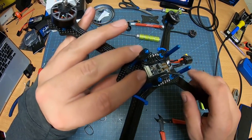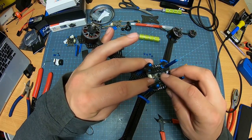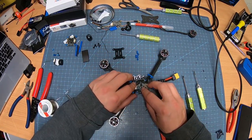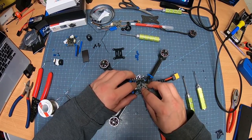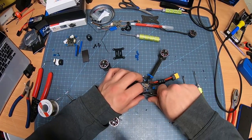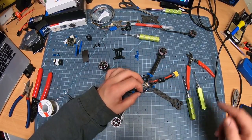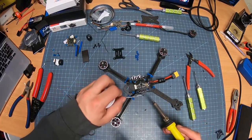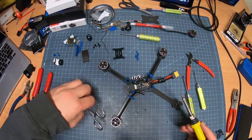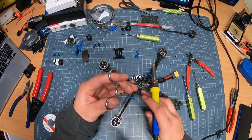If you solder these wires and let them sit over that, and let's say you hit a tree or something like that, your wires might get cut. I think proactively on this, and I will make sure to situate those wires to where they're not hanging out right on top of it or anything like that. Make sure to space it out like so here. Cut off a little extra on that one, so it'll overlap the wires and not the actual obstruction, something that can cause damage there. That way, you're already eliminating that possible issue.